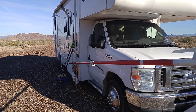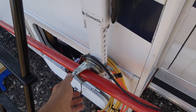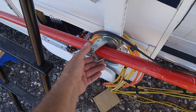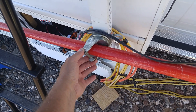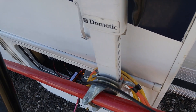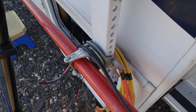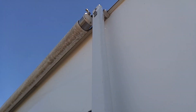When I go to install it, I do it all in reverse. The pivot point here you may recognize as an office chair wheel — I took the wheel off and kept the center axle. I used a pin with a wing nut that goes through my awning mast. I did have to drill a hole, but it doesn't hurt the brackets or the mast.